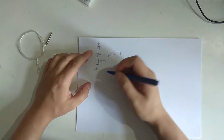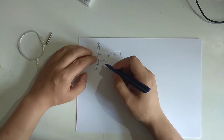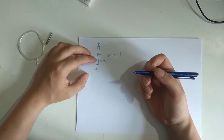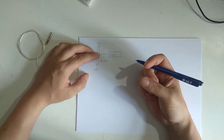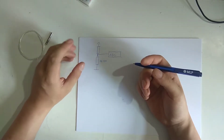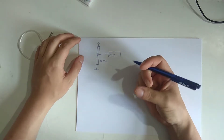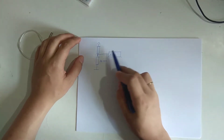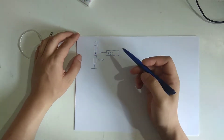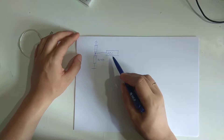Also, if this is 100 ohms, the voltage you're going to generate here is going to be rather small. The voltage change from, let's say, 10 to 50 degrees would only be about 20 mV if you're passing 1 mA, which is a good sort of current to run this at. Most ADCs aren't really that accurate, and if you use an 8-bit ADC, that's almost on the limits of what it can do.